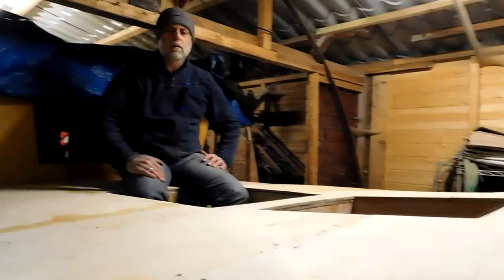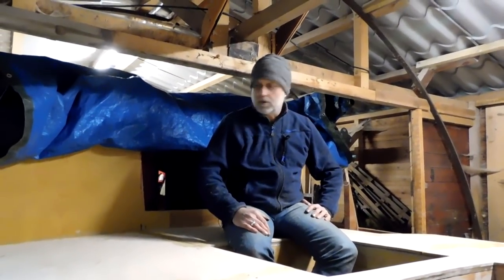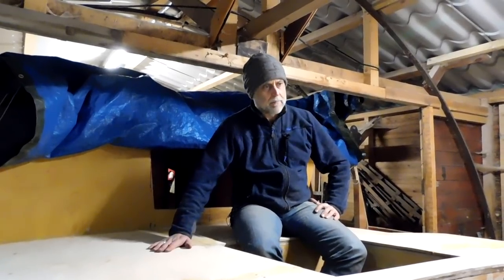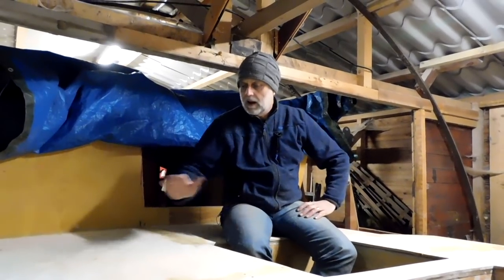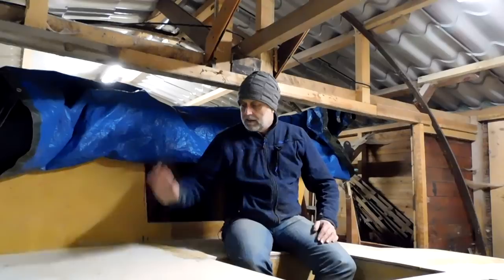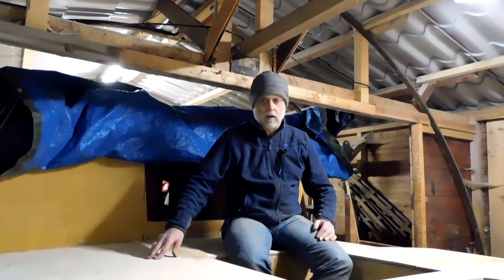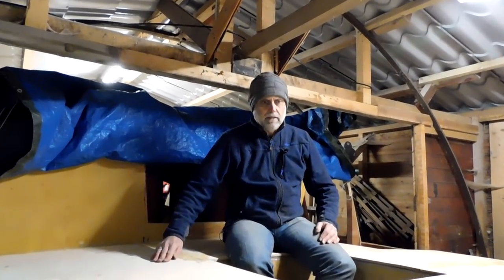Those of you who have been following me for ages know what I do, I'm sure, but just in case anybody's new and is not clear on what goes on, for these aft deck boards, I've epoxied, there's two layers of 10 millimeter ply. I've epoxied them together, so there's epoxy between the two layers. They're then nailed on with bronze ring nails, or grip fast nails, if you like, silicon bronze, which stay in.